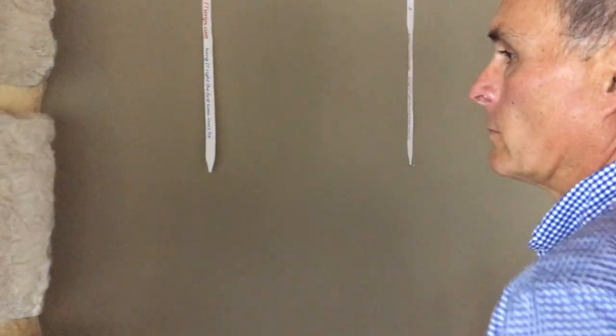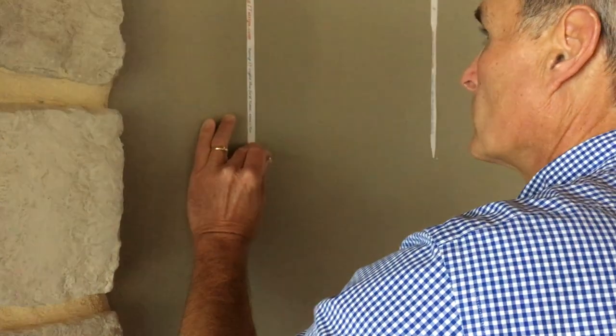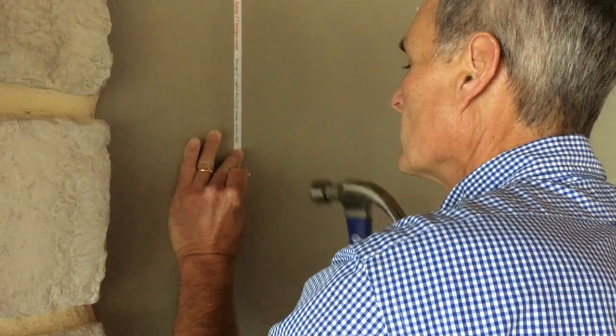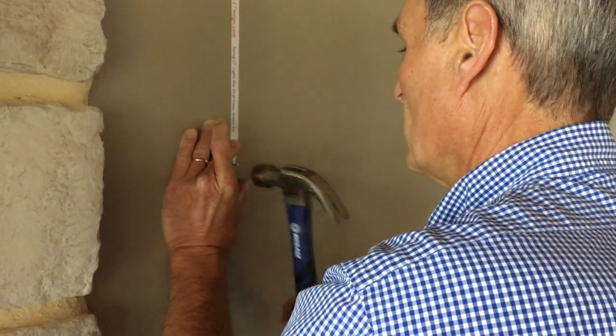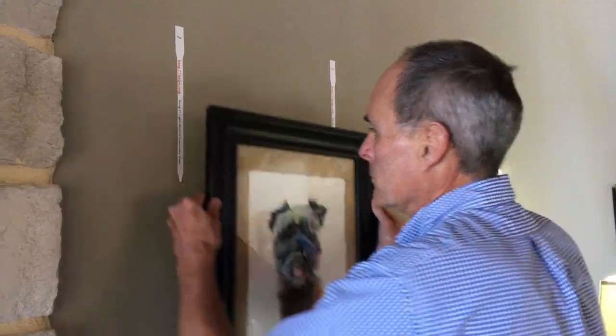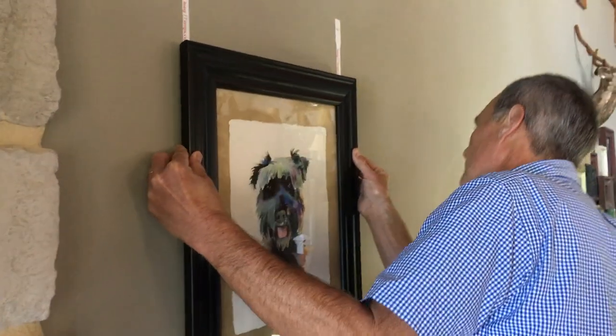As you put in the nail at the tip of each hanging strip, make sure that you get the slack out of each hanging strip. Put the nail at the point exactly where the hourglass broke. Now we're ready to hang our artwork. Hang both d-brackets on the nails.